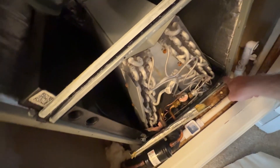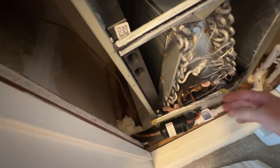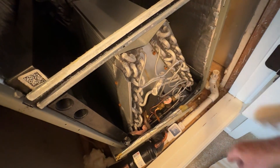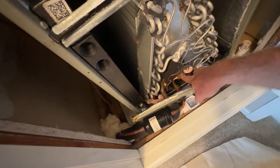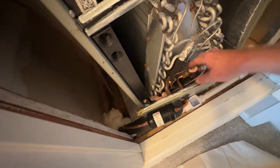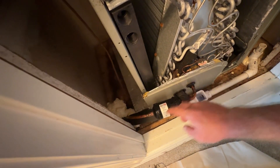So I took the little grooves out already, cut the screws out, take this bar out. I'm going to pick this up a little bit — we should have some play in the drain so I can get the drain cut right there. If not, I think I can still get it cut. Then I'll loosen this here, because usually they come with a new TXV, so I'll loosen that, get the new one in, get everything set up, put putty around here, and then change out the line dryer.